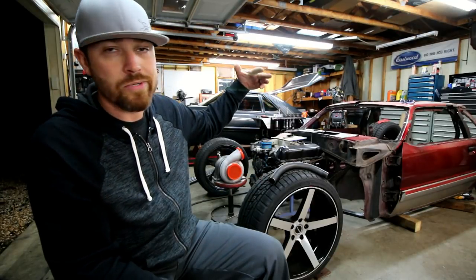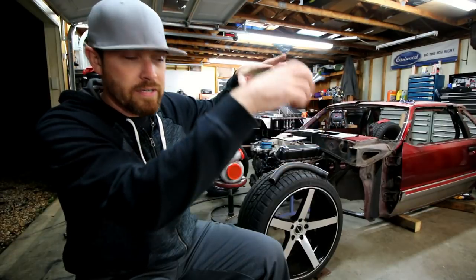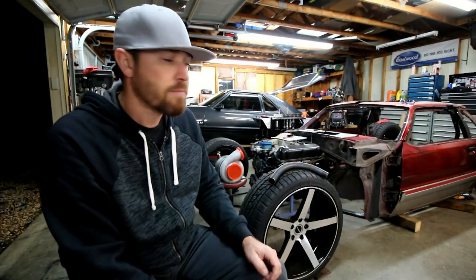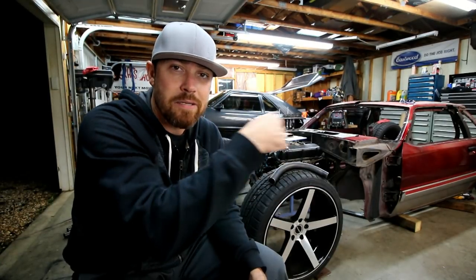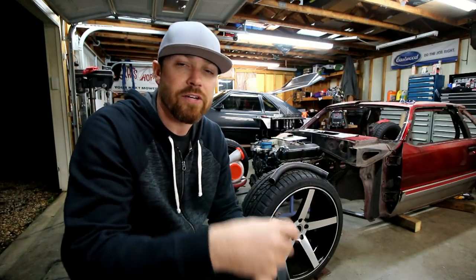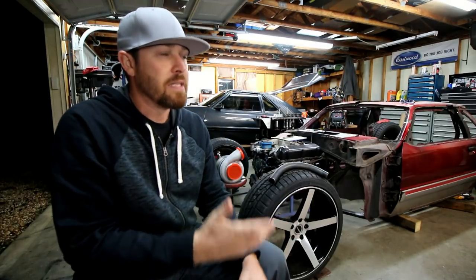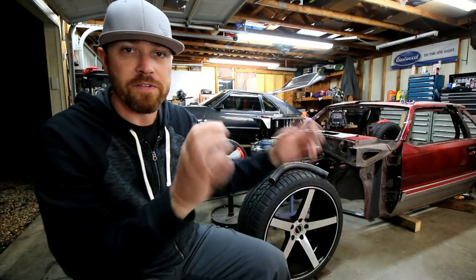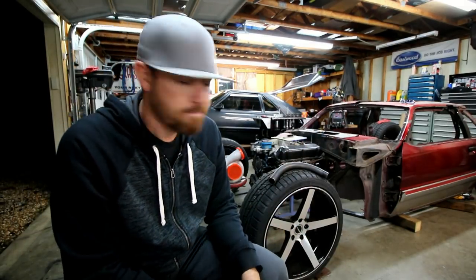I knew it needed to go 8 inches off center, 65 degrees, 5 inches, 25 degree bend, and so on and so forth. So then when I put that thing in the bender and actually marked the first one, made a bend, marked it, measured off 8 inches, 5 inches, whatever it was, in the end I got exactly what I needed for that main hoop. And then all I did was just flip it around and start back from center and do the exact same thing on the other side.